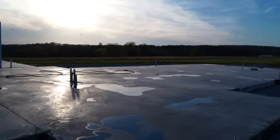And because concrete dries in certain stages, and since it was really windy and hot that day, I had to sit out there with a hose and hose it down. The way concrete works is, when it starts drying, it's like an exothermic reaction and it produces heat. The bottom of the concrete dries slower than the top, just because if it's a sunny day, the sun is going to beam down on it. Not only that, you have surface tension. If it is really windy, and that day it was super windy, the top is going to dry way faster than the bottom. To combat that, you spread water on it after it's all polished. That way you keep the top part cooler and reduce the chances of it cracking, because if it dries faster than the bottom, you'll have a bunch of micro fractures within the concrete.